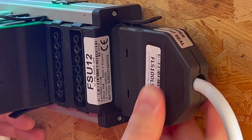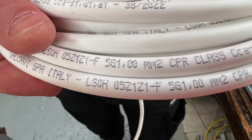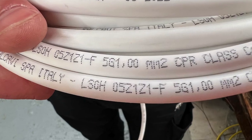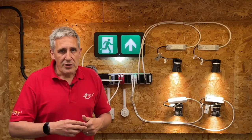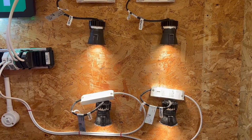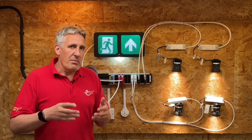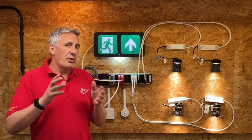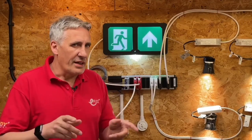The current rating is 16 amps per pole, and the fixture leads can be wired in anything from 0.75 mm² up to 1.5 mm² cable depending upon the type of fixtures you're using. Lighting fixtures can be individually connected or can loop in from fixture to fixture, and this arrangement matches the flexibility of the DALI protocol in supporting star or looped wiring arrangements. This system is a rapid and easy way to connect lighting within commercial applications.